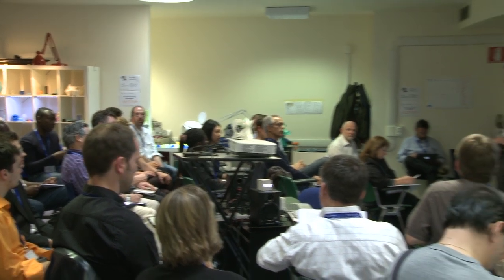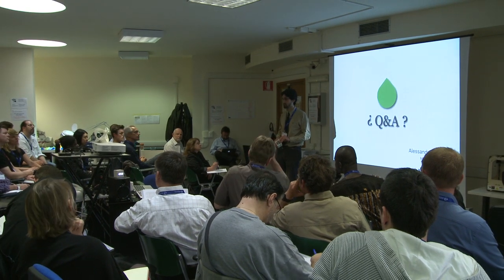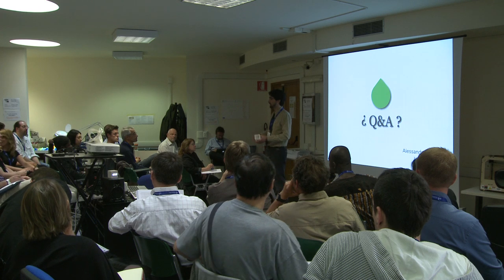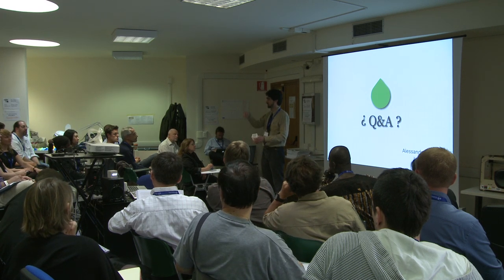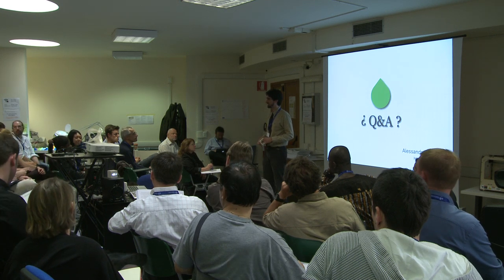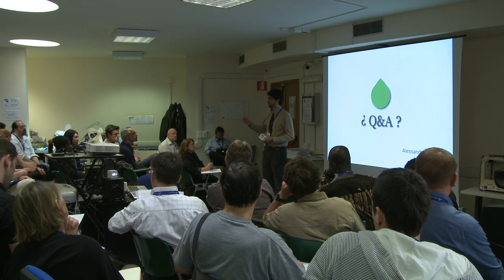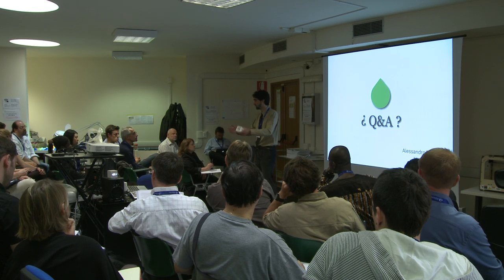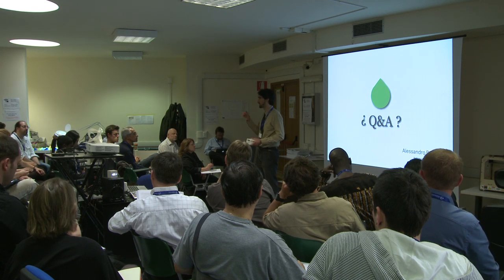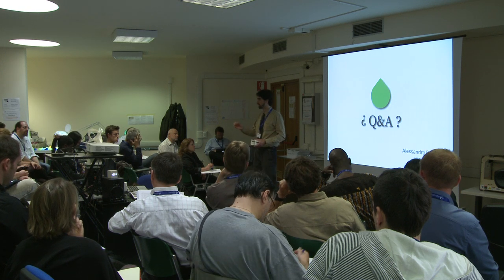So, is there any other way? To make them yourself, you mean? Yeah. Well, you need, for example, a drill. You take a block, and you cut a hole. Yeah, and what's the smallest hole size? You can go down to 0.3. You could go even lower, but it's worthless. So you need a 0.3 or 0.35 millimeter drill bit.